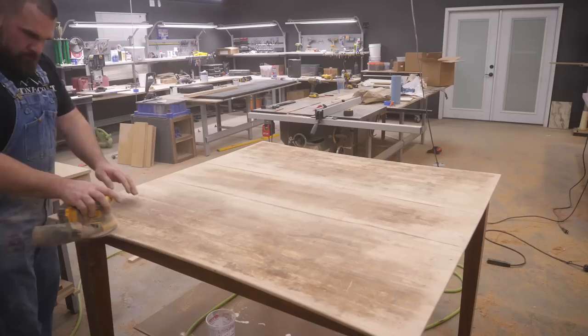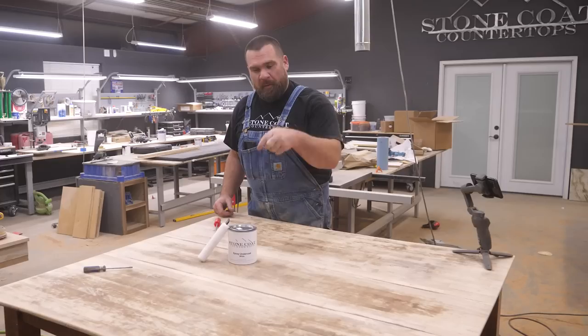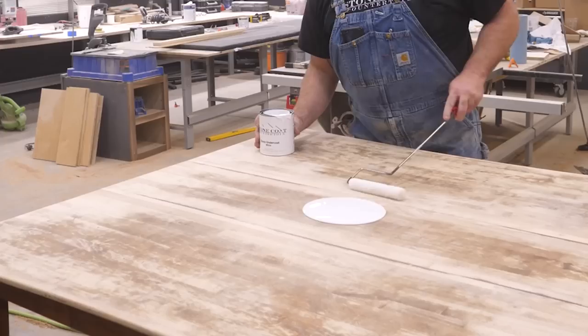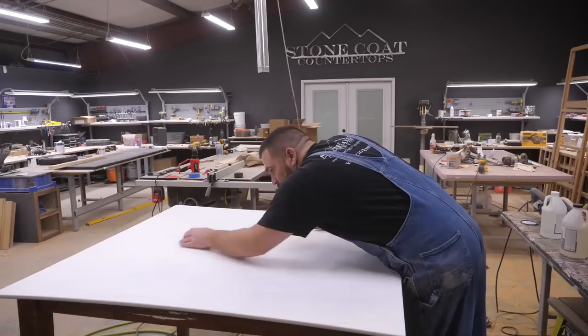Finish off sanding the project with 220 grit. You do not need to be perfectly smooth — the epoxy will overcome pits, knots, and scars. My leaf is permanently installed. It is now time for two coats of epoxy undercoat in whatever color you choose — I'm going with white for this project. Stone Coat's epoxy undercoat applies easily, is ammonia-free, and each can covers over 40 square feet. This stuff dries quickly so you can get to pouring epoxy. We offer two colors of undercoat: white and black. First coat is dry — now I'm going to sand with 220 grit and apply one more coat.